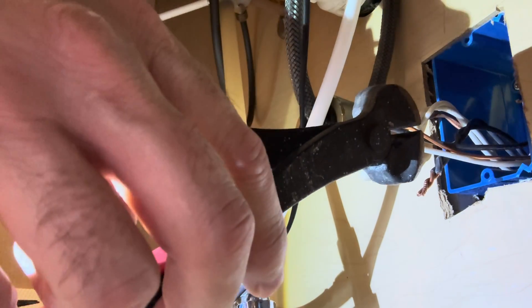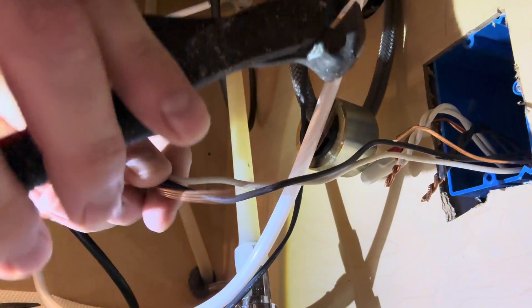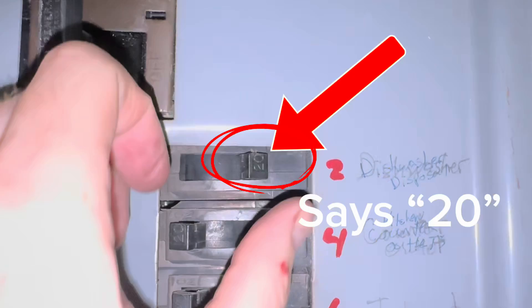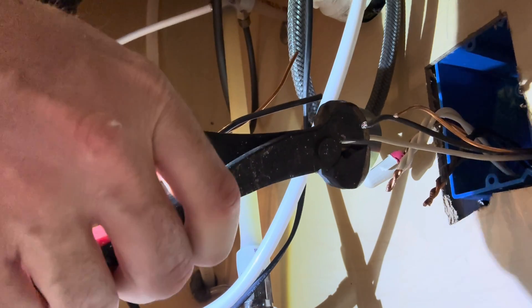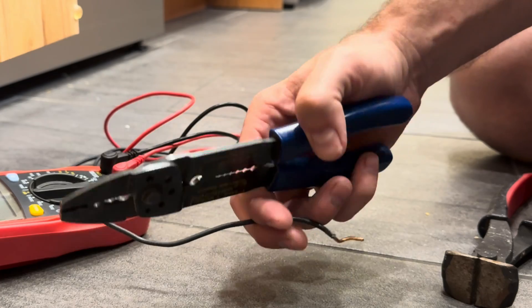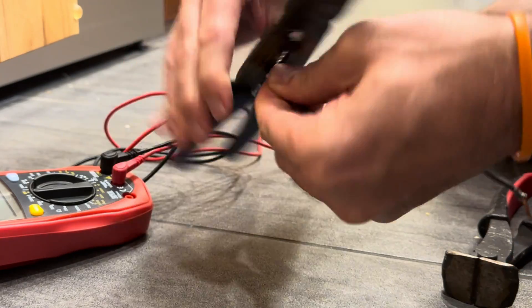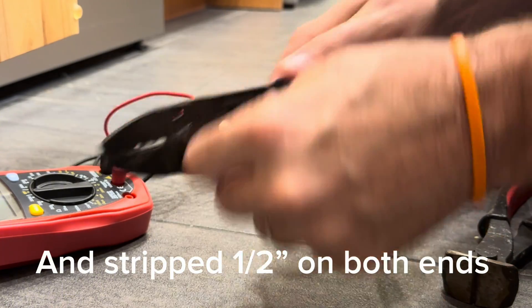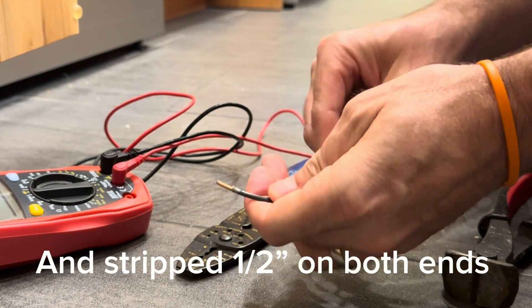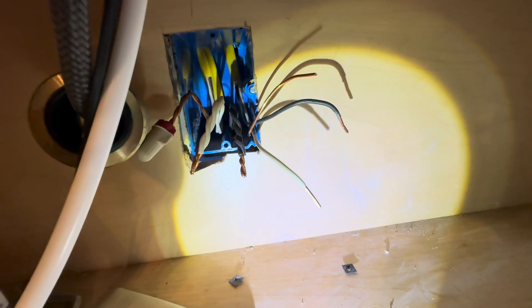From that point, I cut off the ends of those wires and worked with the 12-gauge wire already in there. As for whether to use 14 or 12 gauge, you should check your breaker box — I had a 20-amp breaker, which requires 12 gauge. Research that to make sure you're using the proper gauge rated for your situation. I snipped off about six to eight inches from the existing wire, since there was a lot of it bundled up inside the electrical box, and used those pieces to create new pigtails.